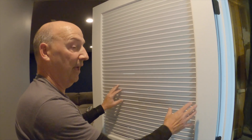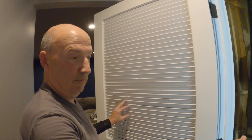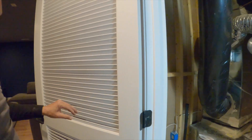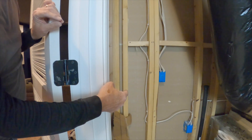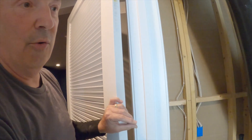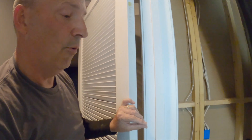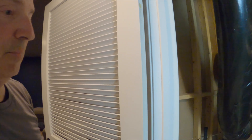If you did not have that — if this were a solid door, or if this were not supplying enough air for the appliances that we have inside — we would then put grills into the non-confined space, which would be out here in this living room. It's got an open stairway going upstairs, it's really open to the rest of the house. But it's something that a lot of times a homeowner doesn't think about: we need to make provisions for combustion air when we're confining your gas appliances.